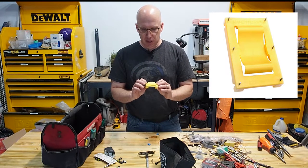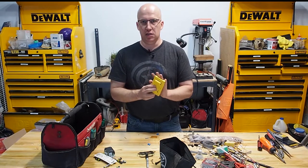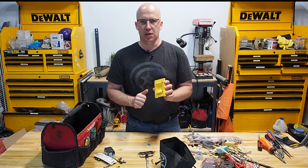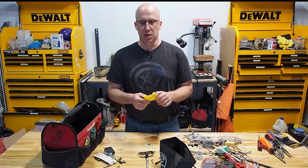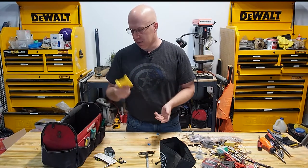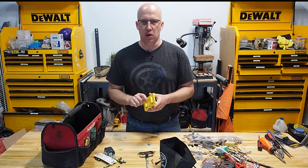So when you put the electrical box in, and if you haven't installed the outlet in, this slides into the outlet. So if you're marking the drywall, if you have to do a quick patch, this lets you know all the different corners that you need to cut. You cut these out, put it over, it's a perfect fit over the drywall instead of trying to push it in place and using your roto-zip or other tools to cut it out. So I'm gonna leave this in here, but again, this might make it back into my drywall toolkit instead.